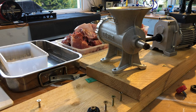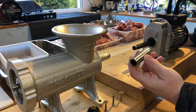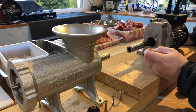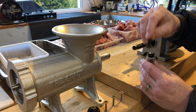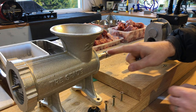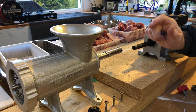So that fitted in there beautifully. The whole purpose of this thing was to be able to join these shafts together. And what I found in my box of bits and tools is an old spark plug — 16mm. The rubber's gone out of there now but it fits on there magnificently, just as you can see. So, it's on there, it didn't go anywhere. So how do I make that to that? I just put it on the sander, took off the two sharp points and ended up with effectively a bolt that fits on there perfectly. Because it's high tensile, the strain imposed — it's quite a lot of force on that bolt — it's self-tightening and it doesn't go anywhere.